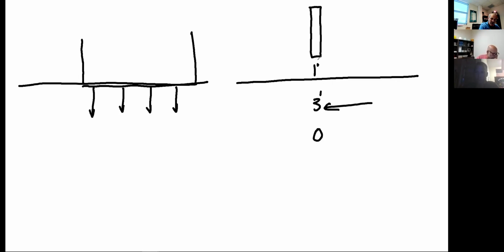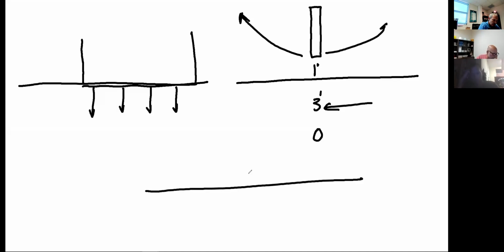Another part of this, especially when you start doing the gain adjust and getting directly over the cable, is why I don't like to sway it back and forth. If I've got the wand on the ground and I take my depth measurement, but my conductor's over here, it's 3 feet straight down. Is it 3 feet when I've got it off to the side? No, that's not the closest point distance between two points. So you're going to give a false measurement, and that happens a lot when you sway the wand back and forth trying to find maximum signal.